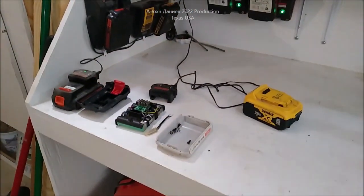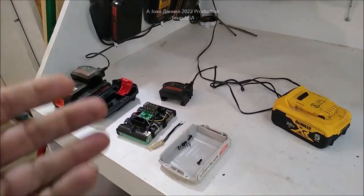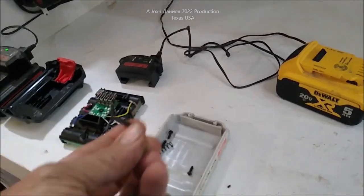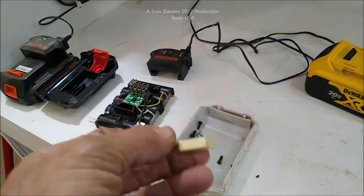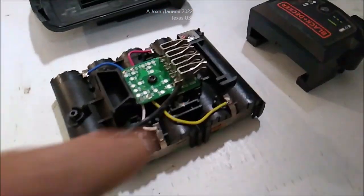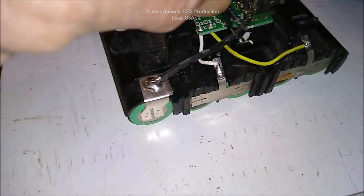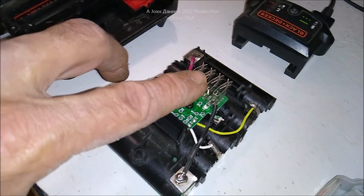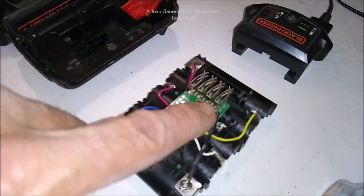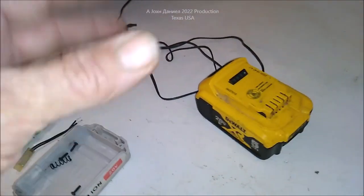Have you ever had a tool battery go into overheat function — in other words, the battery got too hot and shut down? What's commonly responsible is a much smaller version of this bimetal disc or bimetal switch. This one is buried right in there — you can see a little white temperature paste — and it goes up to the little board and breaks the contact, which doesn't allow power to charge or, in most cases, power to come out.